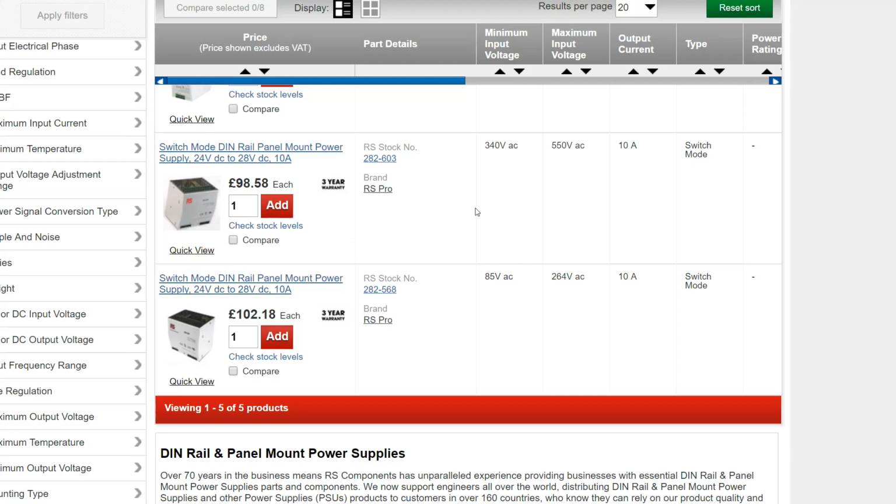Meanwell is a very, very good make, but if you want to have that next level of manageability, and you want to have proactive fault detection, so if your power has gone up and you're consuming more than you would normally do, get somebody out there to have a look why, one of these other power supplies won't do it for you. You would actually have to add separate current and voltage monitoring devices to this in order to get the same things. And how much would that cost you to add into here?